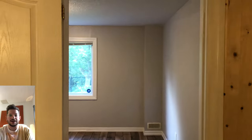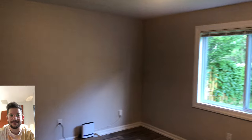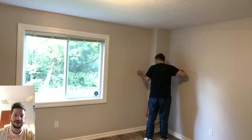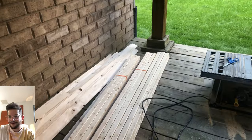Chapter two is the control room wood cladding, and then we're going to get into some of the framing for the control room as well. Here you can see the blank slate for the control room. We're going to wood clad this room; however, since we are doing custom wall-integrated bass traps that work into an acoustic wall, we are going to get everything framed out on the walls first, and then do our wood cladding around that. There's going to be a lot of surface area in this room that will not require the wood paneling since it will have fabric and acoustic insulation.